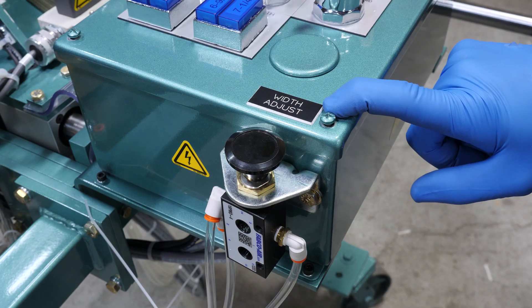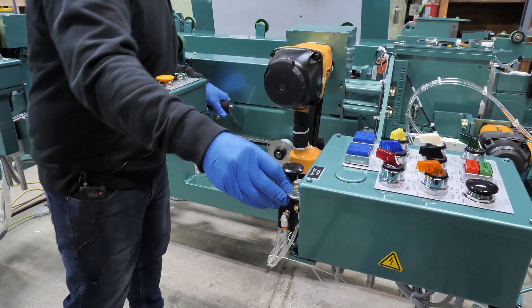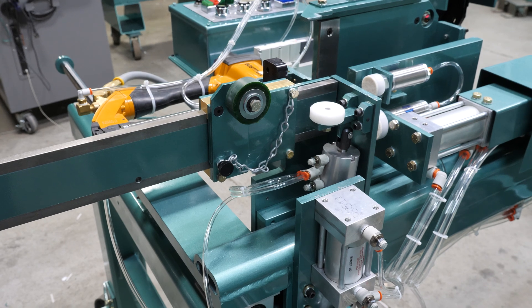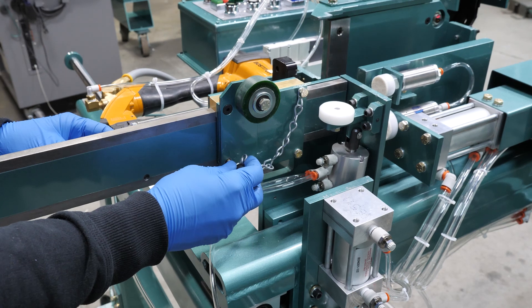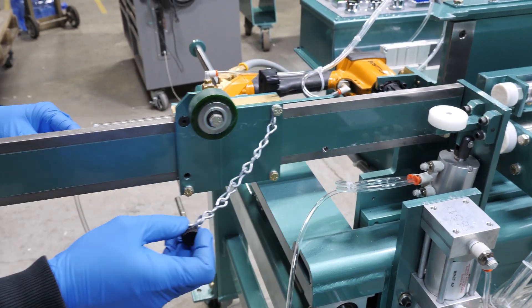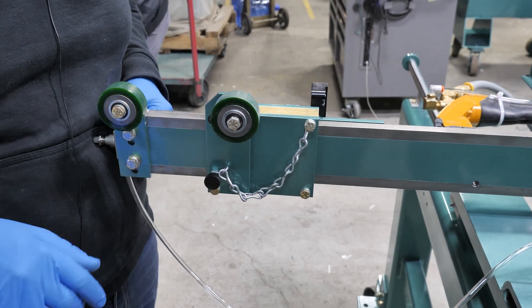With the width adjust, we will be able to set the width of our door. By pulling the knob out, it will lift the clamps. Your adjustment is made manually here to find the correct collar bar, and then the valve is activated again. Once you have your door width set, you will also need to set your door length. This first position is set for a 6-8 door, and we can switch it to two other positions: a 7-0 door, which would lock in here, or we can go into an 8-0 door, which would be at the back. This needs to be done on both sides, on either end, depending on a left hand or a right hand door.